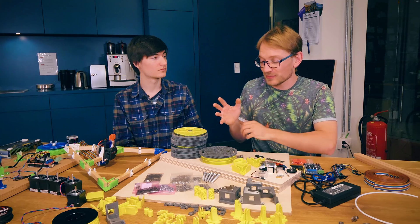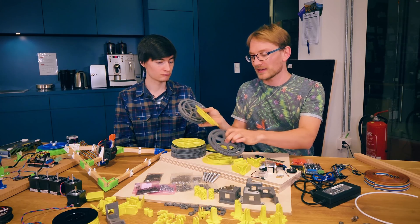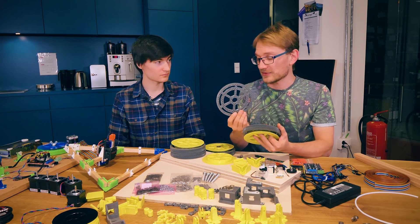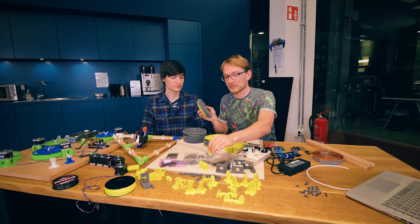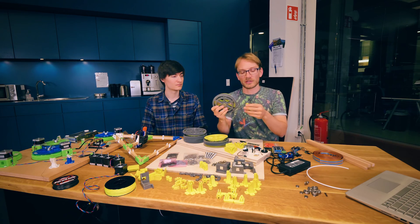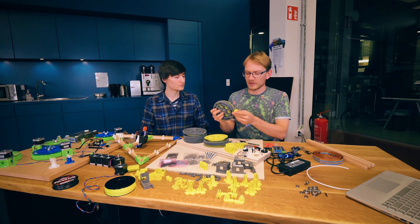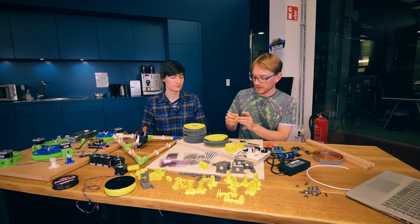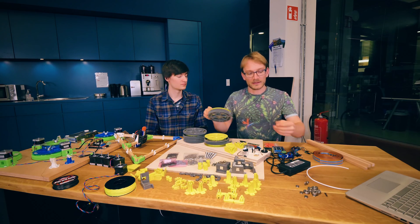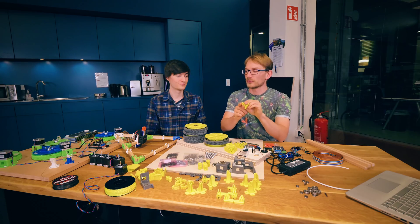For printed parts, this is the area where you have the highest plastic investment in the entire printer. The gears that hook up to the actual spools took quite a while to print, but they were printed at 20% infill with three walls — you don't need them that solid. These big gears have a nice herringbone profile; these are the motor pinions. Nylon would be a good choice for these to make them roll smoothly, but PETG to PETG also works, and you can grease them up. You can leave a relatively large gap so you don't have to print them super fine. You'll also need standard 608 skateboard bearings and a few of these 623 V-groove bearings, since you have quite a lot of line rollers to guide the fishing line.